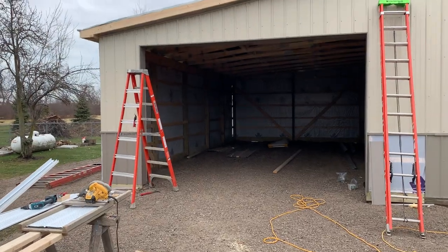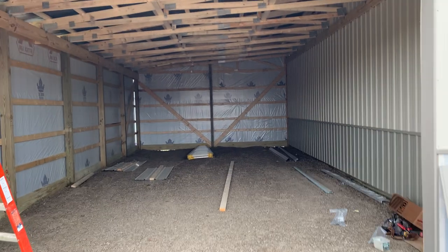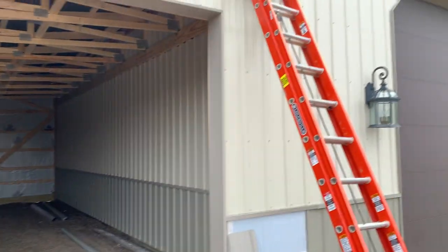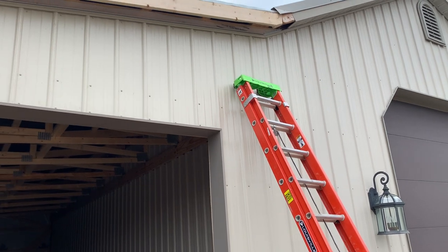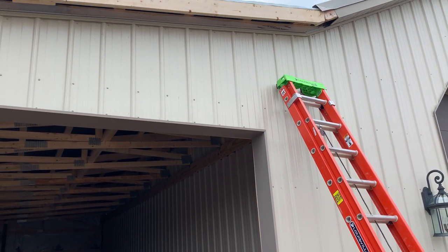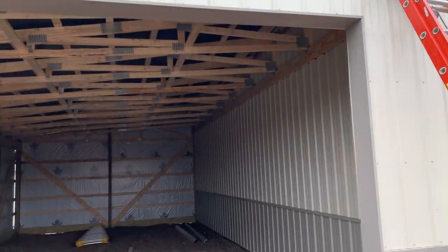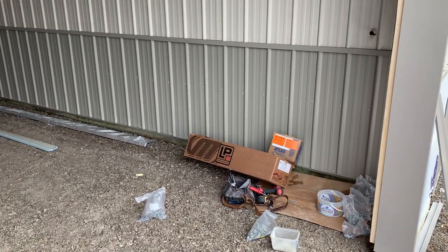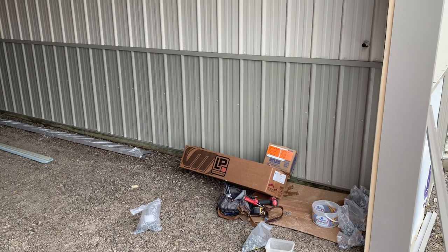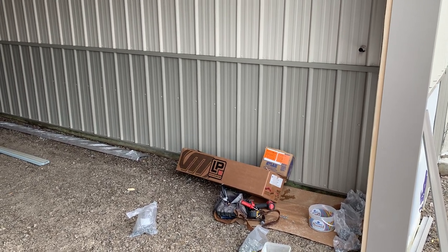You can see here as I walk through — 20 feet wide. We'll go in here and look at the trusses. That's how you do it: you've got a building that's 6/12 and you want to do a lean-to, extend it, add a little more storage. We did a mono truss right there, a 1.5 slope off of that. And what we did is we put the wainscoting actually on the interior — closed that off, 3-foot wainscoting.